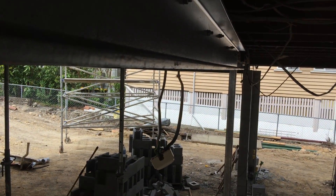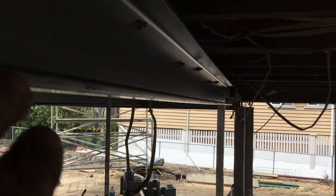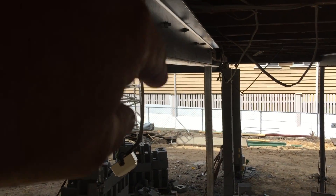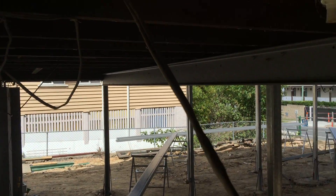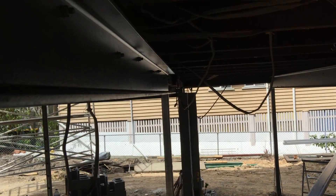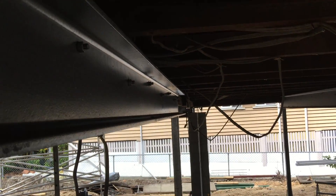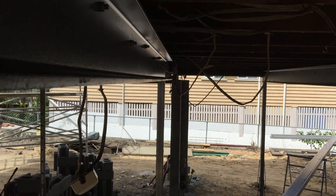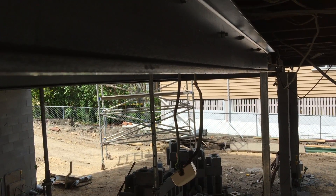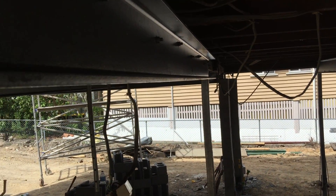The steel beam has now some downward weight on it which reduces any bounce. That steel beam is now working for us — it's pushing up the whole time while the house is pushing down, so hopefully we reduce the bounce. This is something that most people don't do anymore. If you're wondering why your house is bouncy, that's the reason — once it's been remade, if they haven't tensioned the beams, you have bounce. Doesn't mean you don't have bounce afterwards, but you sure have a lot less, depending on the weight of the house and the size of the steel beam.